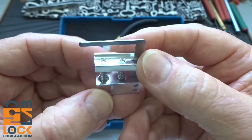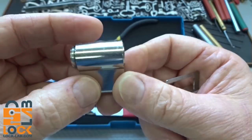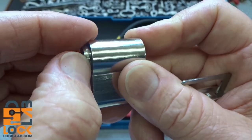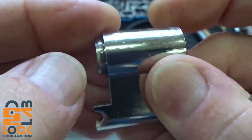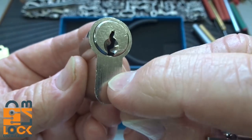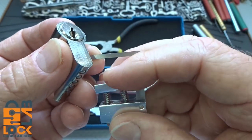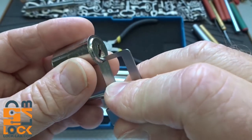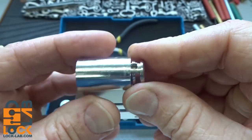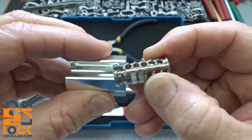That slot gives us a clue - these are actually designed for European locks. These are really difficult to find little tools, and when you find them they're usually pretty expensive. Here's a euro lock I've gone ahead and cut in half so you can see it. Usually there's another half on here and a circlip located in that groove. You remove the circlip, then you can move the core in and out after you've picked it, but all the pins in the bible will go flying. That's where this follower comes in - you compress it and slide it in there, and that spring tension holds it in place.